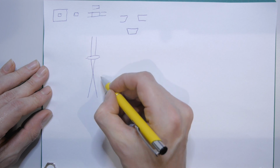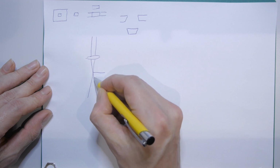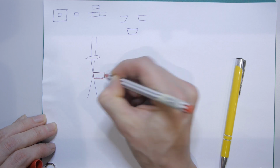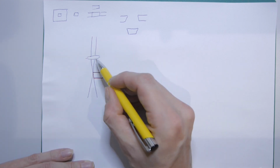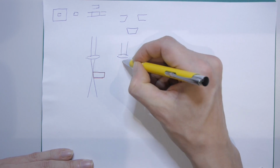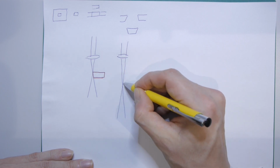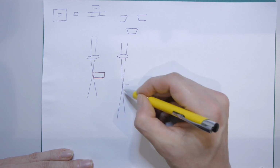And now when we place our acrylic piece here and the laser cuts, you can see what comes out here. There it is, the angle that comes out when we cut out any acrylic piece. You can reduce this angle when you change the lens. There are other lenses that have a longer focal distance, and then it would come out with something like this here. And you can see the angle when we cut the same thickness of material would come out smaller.